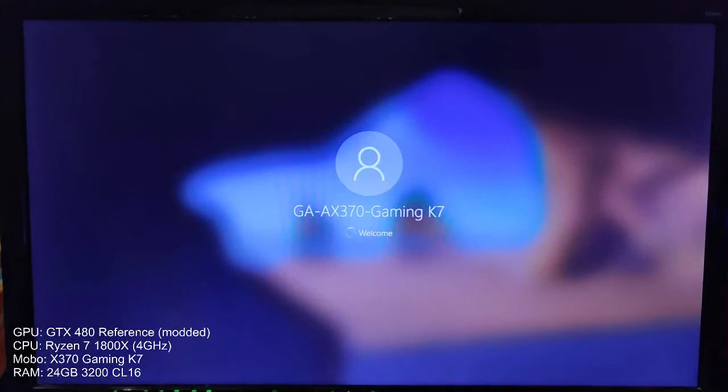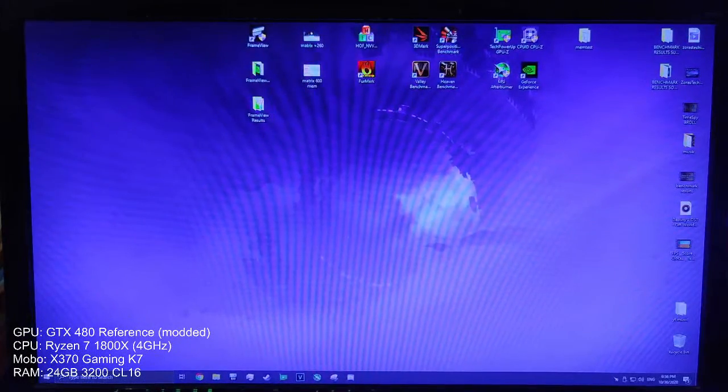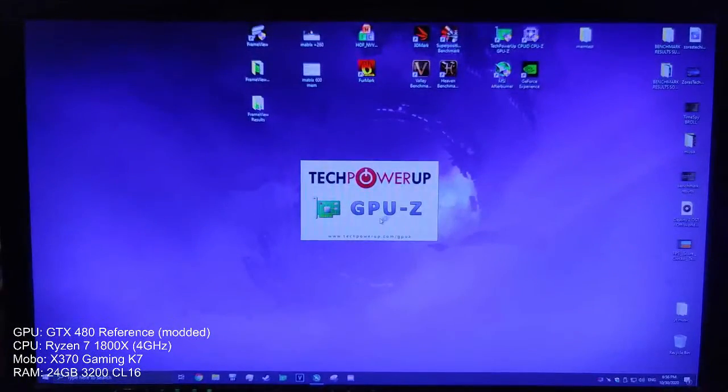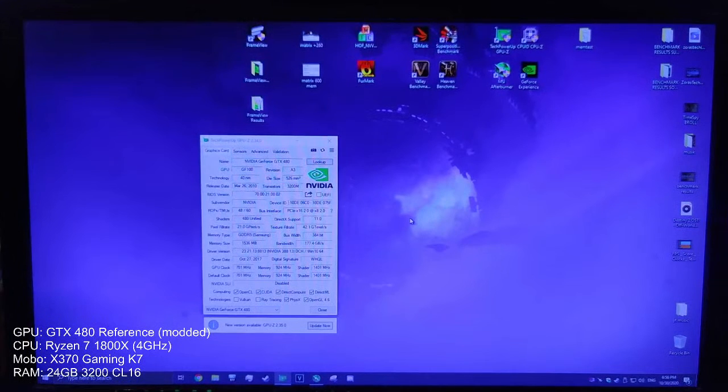Try a different PCI Express slot. Yeah, the 8x slot always works. The thing is just, in the 8x slot, we have PCI Express 8x, and the thermals are worse because there's less airflow. So I like to have it in the 16x slot, because we are already locked into PCI Express 2.0. Still at 8x. What the... Why? It could very well be because the card is missing some multi-layer ceramics from the PCI Express interface. It might well be that it was always running at 8x and I just never noticed.